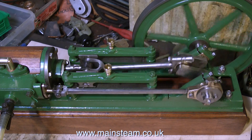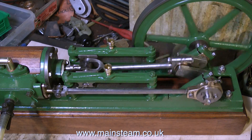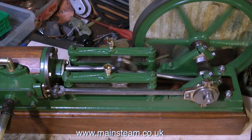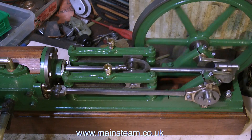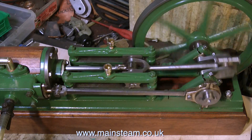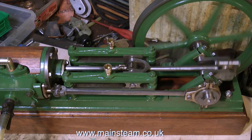And then of course there is the flywheel runout problem, and a lot of people have sent me messages telling me how to do this. I think I've got a fairly good idea how to do that, but no — I'm not going to bore out the flywheel and I'm not going to sleeve it. I'm just going to creatively use some shims, like they did in the old days, and it will run quite true when I've done that.